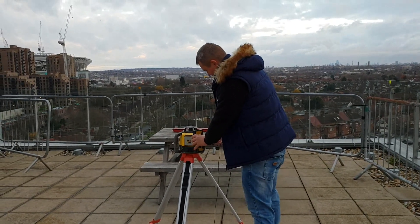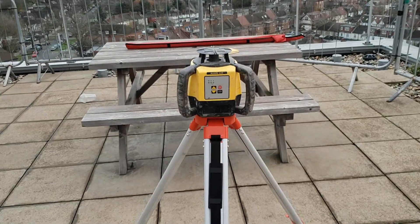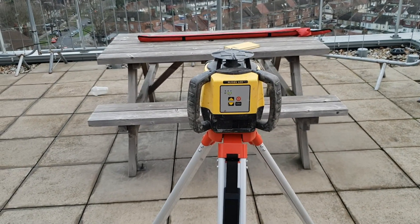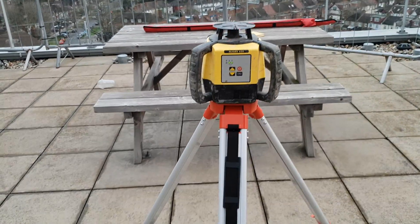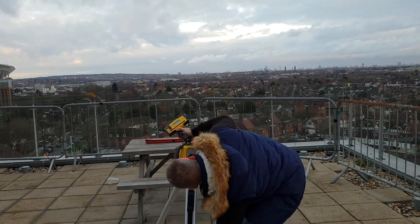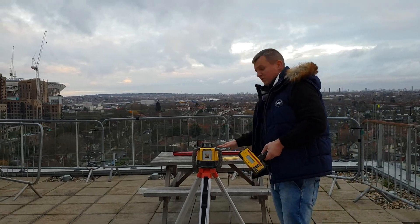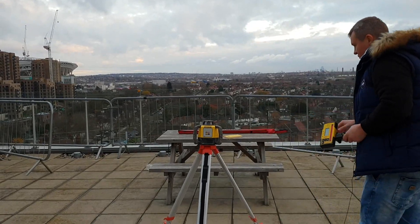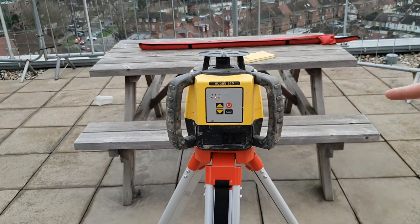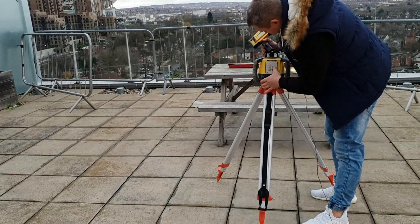I'm going to take the receiver off it now and we're going to turn on the laser. As you can see it takes a little while for the self-leveling and it's going to start running in a second. You can see now it's there, but I want to show you one thing — if it's not going to be level. It's self-leveling but only to a certain degree, so you're going to see what happens if it's out of level and it cannot self-level. If you see something like this, that means you set the tripod wrong and it cannot really self-level. But anyway, we're going to come back to the level now.